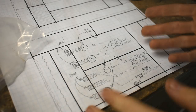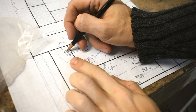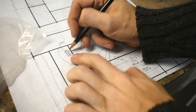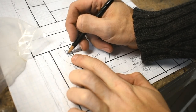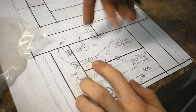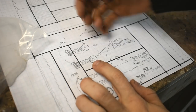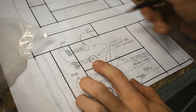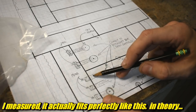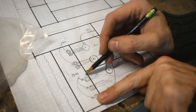I'll show you what I mean. This poor drawing, this top one, shows you kind of how it works. There's this groove. It's kind of a T shape. I bet they used something like a router bit that spins to dig it out so they can stick the element in and drop it down in this little groove. And I got 2 of them. These are actually staggered because, if you remember 5 seconds ago, you saw they were staggered on the inside because they wrap around them. It's got to go up. It's details. We're going to talk about details later. That's the original. Here's how I'm going to do it. 3 courses. Now, to kind of get away with this, I'm going to have to move the top and bottom ones up and down a little bit to make room for one in the middle.